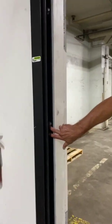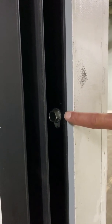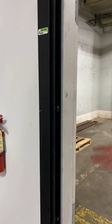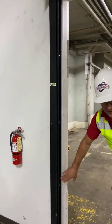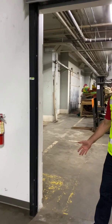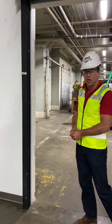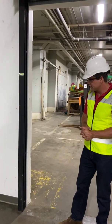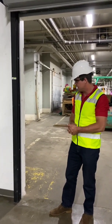If you notice, there are slotted holes — it's a little tough to see, but we do have a slotted hole there. This door is an upward-bias door, so as the door heats up in the event of a fire, the door will actually rise up. It's critical that all of the bolts in the side guide are at the top of the hole. There are upward doors like this one, and there are also downward-bias doors. A lot of installers — about 90% of the doors we find — have issues in these anchor places. That's a common area we see in the field. It is critical it's done right, and that's where you need the owner's manual to ensure you've done that properly.